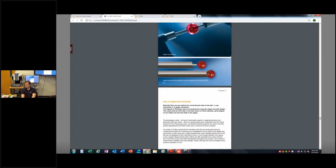If you make something that's even smaller than that, we have to have a shank, the part below the ruby that the ruby is attached to, that has to be smaller than the diameter of the ruby. Well, when we get down to a 0.3 millimeter, the shank on that's like 0.2 millimeters, and there's just not a lot of material there. If you look at those things funny, they break. So those are the kinds of things to start asking yourself.